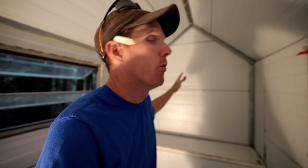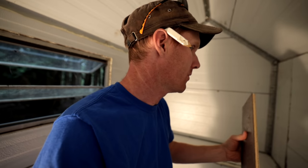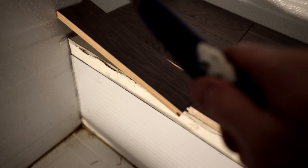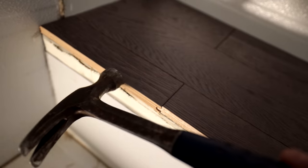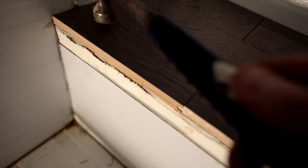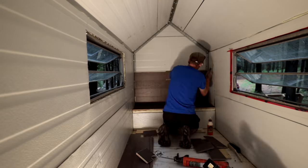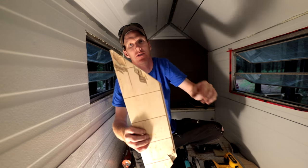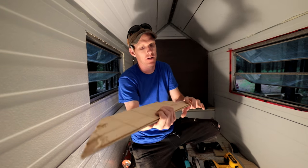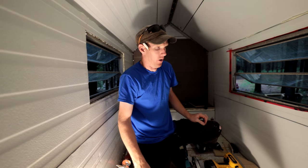My plan is to make an accent wall at the back wall where my fireplace is going, and I'm going to use old scraps of engineered hardwood floor. It's engineered to withstand the heating and cooling process, the humidity and all that — it's about four and a half inches wide by about a half inch thick. That'll go on my back wall and give me a really pretty accent wall. I'm having to chisel out the back of them because there are tech screws holding the metal brackets, but I'm almost done.